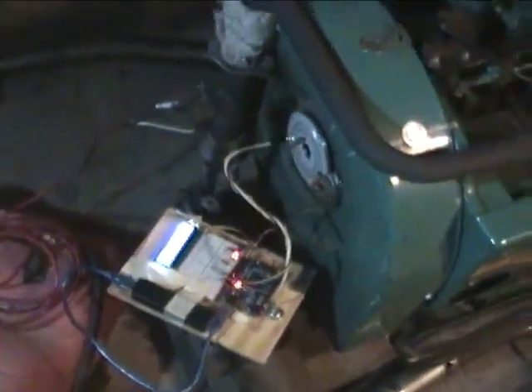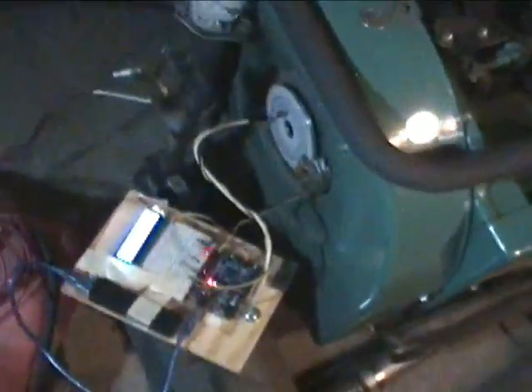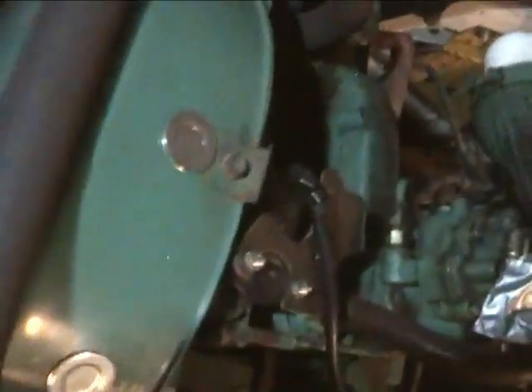This is a test of my new ignition controller that is soon going on my Onan generator. This Onan generator is my main wood gas test generator, and I want to be able to advance spark by at least 40 to 50 degrees or so, since wood gas burns slower than gasoline. Here's what is going on: it's a test of my newest sensor block with north and south magnets. The sensor block is held onto the fan housing with a powerful hard drive magnet so I can rotate it to any position I want. I installed the new timing plate and degree wheel that you saw in the last scene.